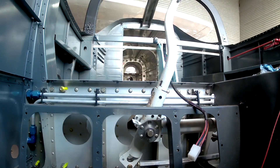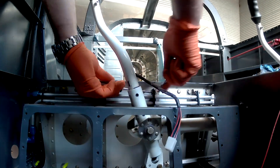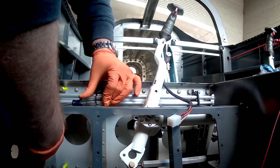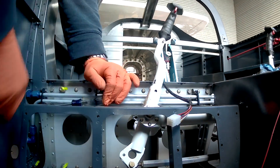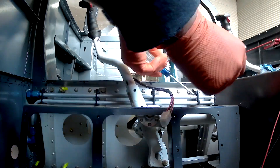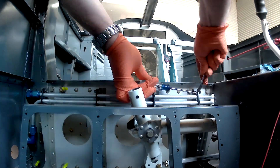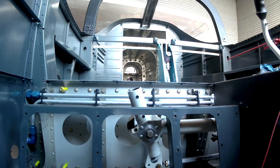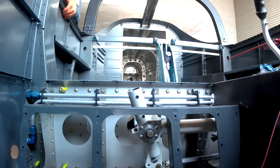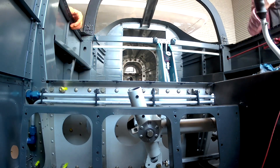Now that we're done with that, it's time to finish tightening up the other fuel lines. This is a special plane — it's got a return fuel line. You can see there are two fuel lines: the bottom one that goes down and turns downward is the regular pickup line that every RV-14 will have. That top line is the return line. Vans makes space inside those — I think it's compact polyethylene blocks — leaving space for a return line. However, my return line needed to be a larger size, so remember I had to increase the size, and that's what it winds up looking like.